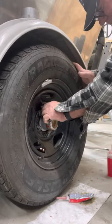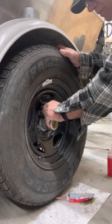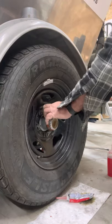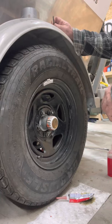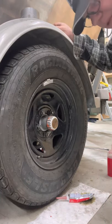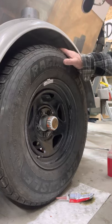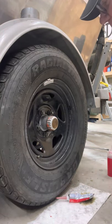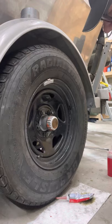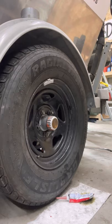I've already loosened this little plug. This is a 1/8-inch National Pipe thread plug — I've heard stories of guys stripping these out, largely because they put in the wrong set screw. It's not a set screw, it's a plug. Some guys have had issues getting them out because thread locker is used on them. I wouldn't recommend drilling one out — if you get one stuck, you've got a whole other issue.